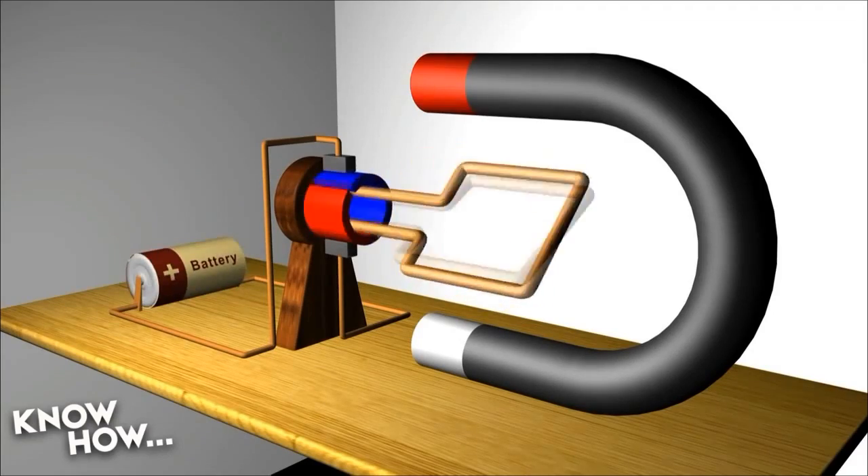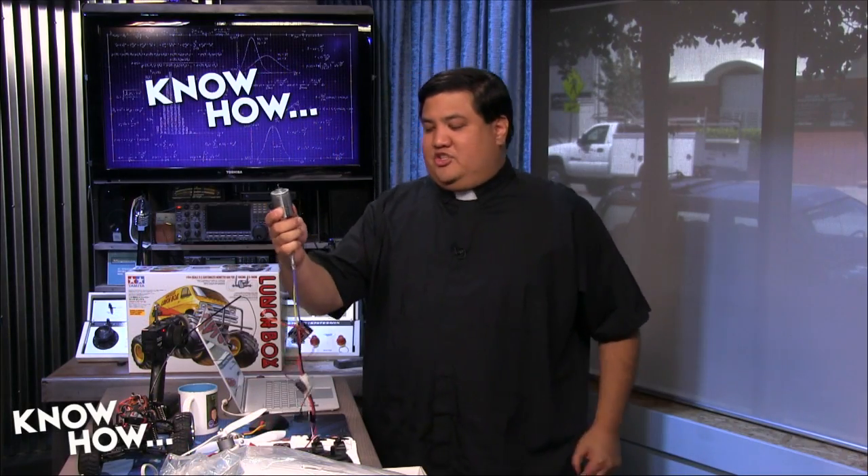There you go, folks — there is a brushed DC motor. Brushed DC motors have a couple of advantages. First, they're actually pretty cheap. We've been making these things for over 150 years, so we've got the technology down. They're also very easy to control as far as speed is concerned, because there's only one control: power. You dump more current into the motor, it goes faster. It's actually pretty simple — no ICs, no electronic sensors. It's a simple, dumb electronic device. Put power in, get motion out.